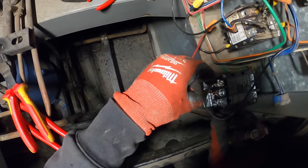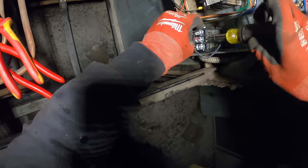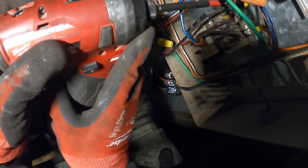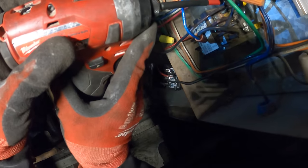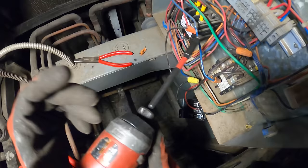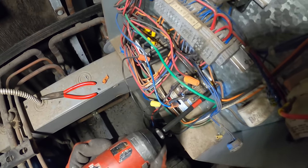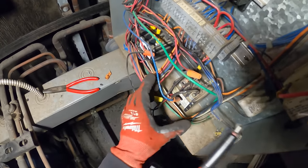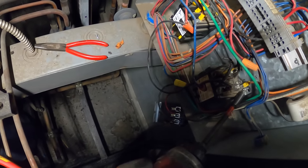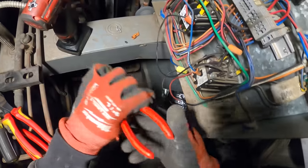Let's make sure we've got 100% secure connections. See if I can get this off and mount the new one in place, then just go wire for wire — take one off the old contactor and put it on the new one. That's all going to depend on whether you have slack on your wiring, so you want to free up any wires.